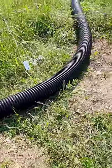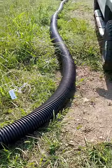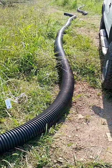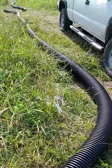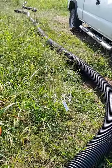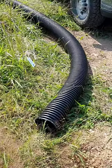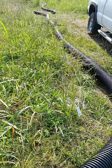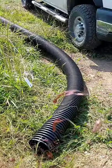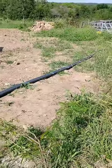And then here, we've got our black pipe laid out and cut to length. It's not all that long of a piece. It's only about 40 feet, but that's what we need to go under the ground. So now we're gonna have to try to get this poked through there. I've got a couple ideas on how to do it. Since the pipe is fairly big, we're just gonna try and poke it in there by hand from this end and maybe drag the black pipe down the PEX. If that doesn't work, I'll try to get a rope or a string worked all the way through this pipe, tie off that pipe to something, a post or something, and then see if I can pull the PEX through it. So it's going to be a little trial and error to see how it goes.